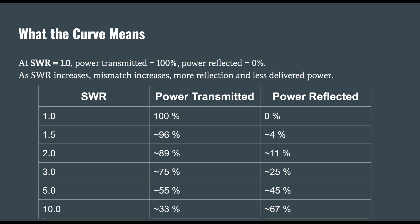When we use an antenna tuner to match our antenna to our characteristic impedance of 50 ohms on a radio, what we do is create something called a conjugate match — a mirror reflection of the input impedance to our antenna, now on our tuner. When the reflected wave comes back and hits that conjugate match, most of it re-reflects back towards our antenna, so that power does get delivered back to the antenna, minus any losses in your transmission line, and will radiate.